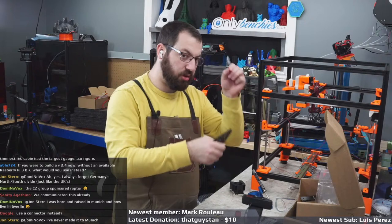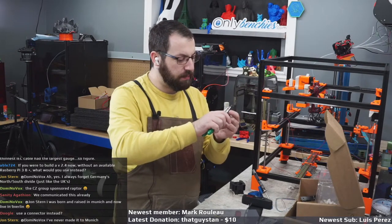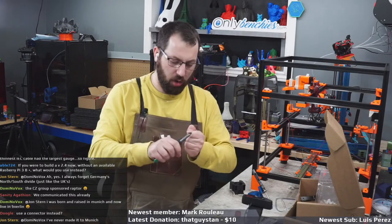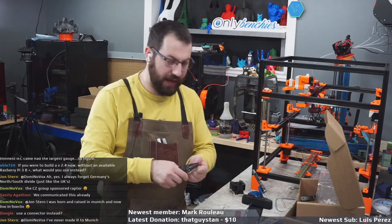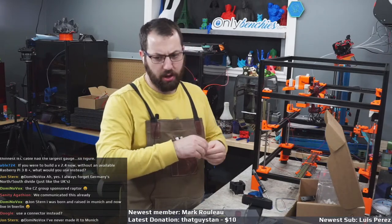But you also want high strand count. It's not just PTFE or FEP coating, you also want high strand count. So you want like 19 strand count, I believe. So if it's 7 strand count, that's not good.